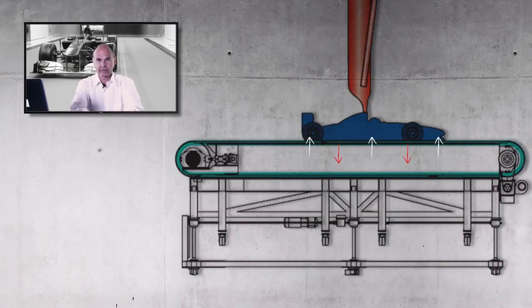So very early on, about 30 years ago or more, I'm getting older, we learned that you had to suck the belt down, and these were synthetic belts, just like a fancy supermarket conveyor belt or a running machine belt, for example. And when we sucked the belt down, that solved the problem for a short time. But then we found we needed more power, because when you suck the belt down, there's more friction between the belt and the table, the surface that it runs over.